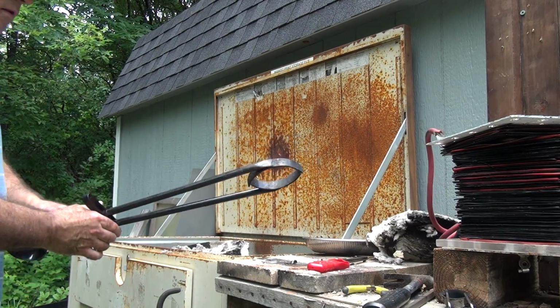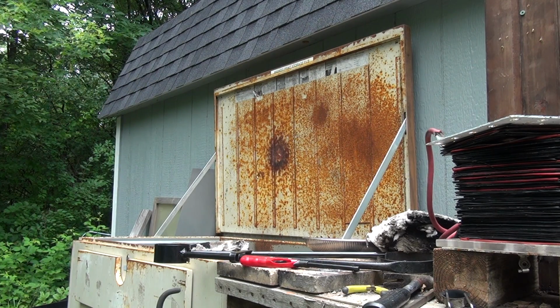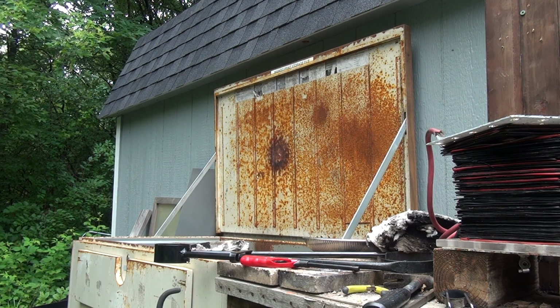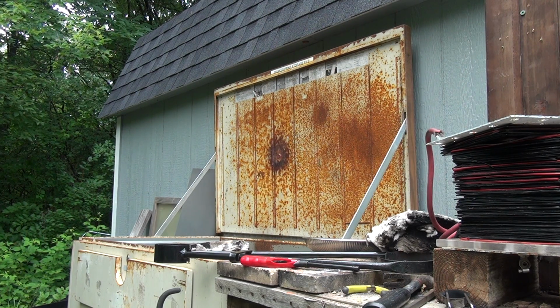Okay, so earlier when I melted the material in the crucible, I had put my insulation all the way on top of the furnace, and just now I had a little bit of skew, because when it first starts, it wants to go out until the furnace is heated up. And so it didn't look like it was totally melted in there. So I took the insulation and put it more firmly on top with a brick on top to hold it down, because the air wants to blow it out. And I think that poop, poop sound you hear is the air pushing the insulation up so it can escape a little bit, which is fine.